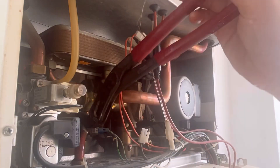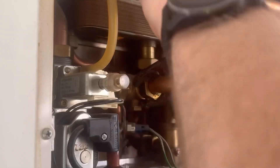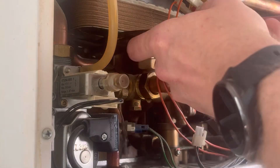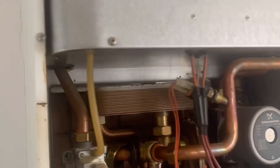I prefer using my big Knipex grips. People are going to say use adjustable, but I just find it a lot more comfortable to use my big grips. Now it is draining down, but as we're taking the nuts off there is quite a bit of water coming out. There are holes on the bottom panel so it's going straight through the boiler, and we've got something called an Urad funnel just underneath - that's just protecting the electrics and directing water straight into our bucket.